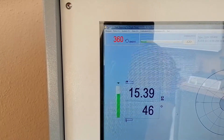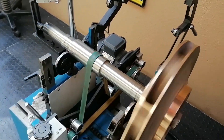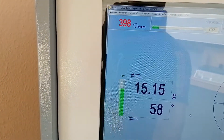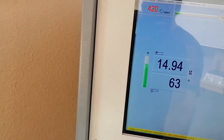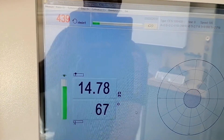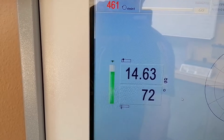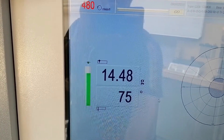I've got the impeller running now and I'm cranking it up to the balancing speed of 500 RPM. As I turn it, the machine locks the speed. She's on 400 now and picking up speed. As it does, the computer is working out the mass and the degree that the unbalanced part of the impeller is at.